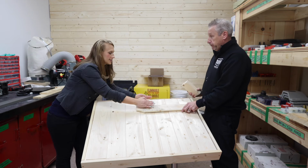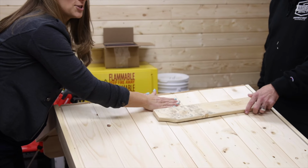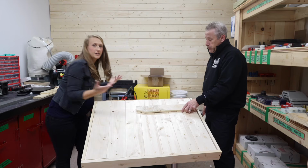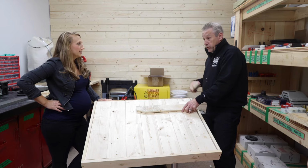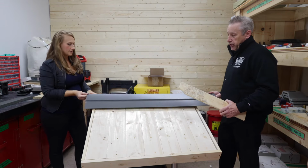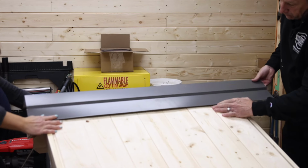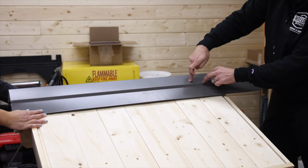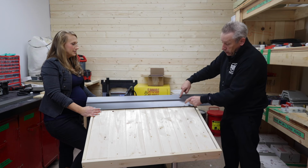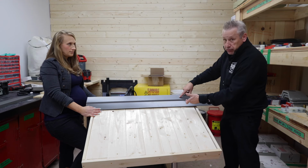Because your ridge is going like this, guys. It doesn't get anchored in here. It gets anchored where it touches on the sides. So if your strapping's way up here and it's over it, you're missing it. Yeah, we can show a ridge cap actually. Perfect. So your ridge cap looks like such. Again, if you have your strap at the top, you'd have to fasten here to actually secure the ridge cap and then catch the strap. Right, which is not ideal. You want to try and get the actual fastener to go as low to the edge as you can. It's going to hold a closure in place at one point in time.